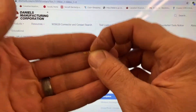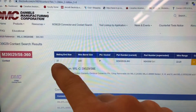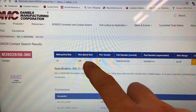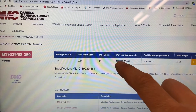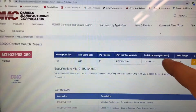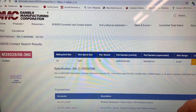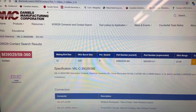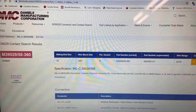This comes up with our pin. This is a 22D size pin or barrel size — it's a pin type. Here's its current part number, and this is the old part number which will be important in a moment. It accepts 22 to 28 gauge wire, and there's the color code confirmation.